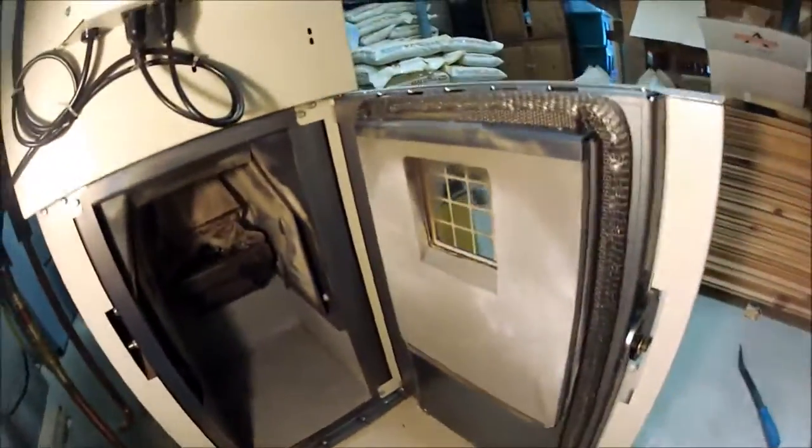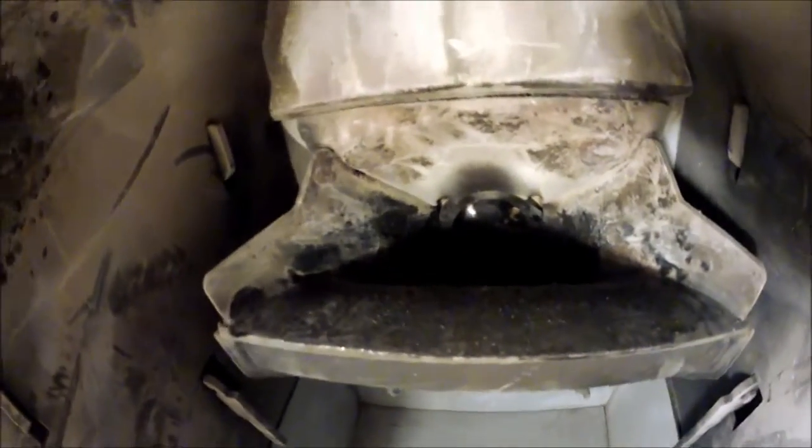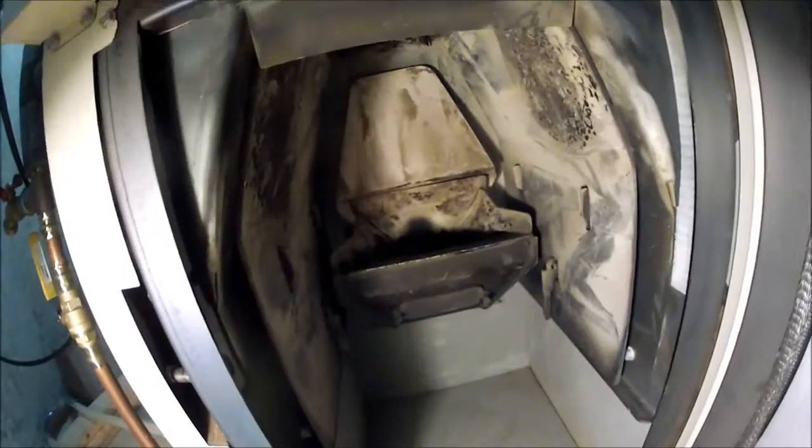So I got to clean that side. She's all cleaned up. Don't forget down in here there's these little holes — you're going to poke them out with a coat hanger or a piece of electric fence wire once in a while. Don't forget to take this plate off and suck out all the ashes in there. Take these side plates off, vacuum up there, put them back, empty that ash pan, and slap her back in. She's good to go.